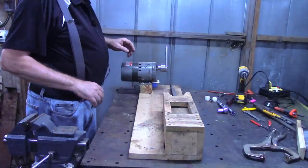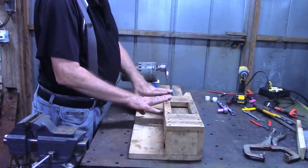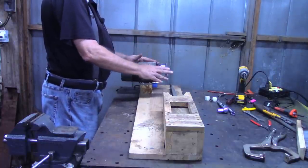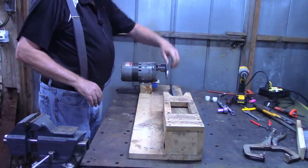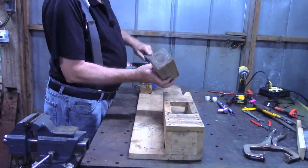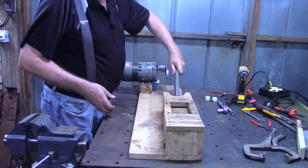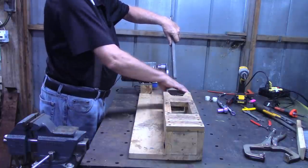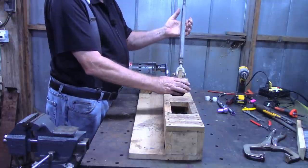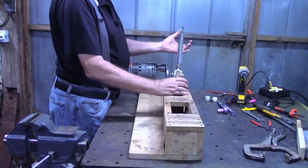Told you at the beginning of this video I would give you a quick little rundown of this Pitman rod can crusher. As you know, the gear motor down here with the eccentric arm is on and off switch over here. The crusher block is nothing more than a piece of 4x4 that I trimmed down to slide in and out of this trough. This, of course, is where the cans drop in. The Pitman rod itself is nothing more than a turnbuckle that I got in a box lot of stuff at an auction many, many years ago, probably 20 years ago.